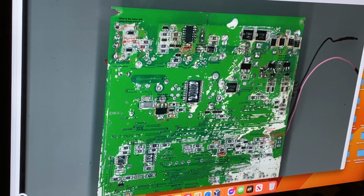Okay, these things here. These are just high speed diodes. These are 1 amp, designated UD1, which is an MUR something. Don't know the number, but they got UD1. Just look it up. SMD or SMT diode. UD1. It's just an ultra-fast diode. It's nothing special about it. So don't use Schottkys there or anything like that. Make sure it's a silicon ultra-fast diode.